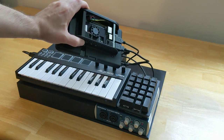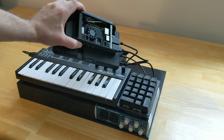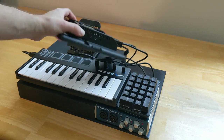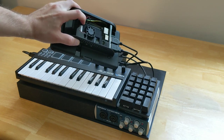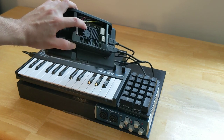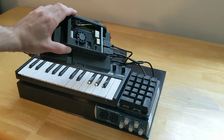And I worked with this for a little bit. I did some load testing. I tested out all the software just to make sure that it could handle what I wanted it to be able to do. I ran some temperature tests and found that it was getting kind of hot, so I did install a Raspberry Pi shim, a heatsink shim in here, with a fan, which helped to cool it off by about 15 degrees. And I do have results of the temperature tests on my write-up.